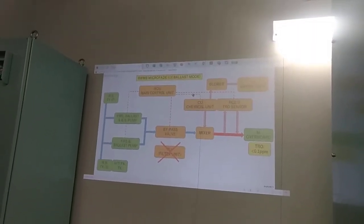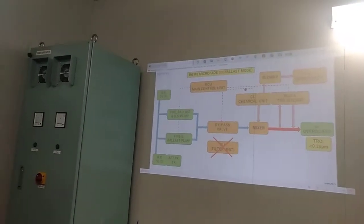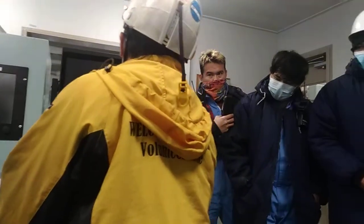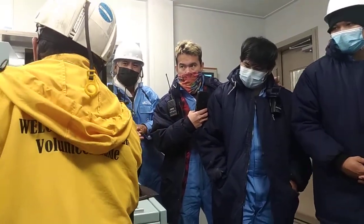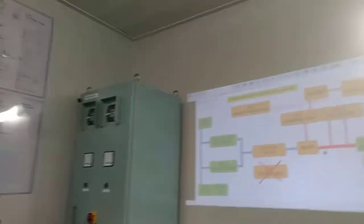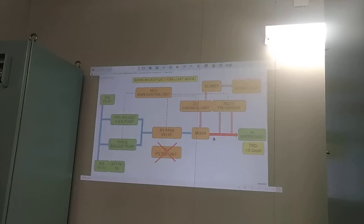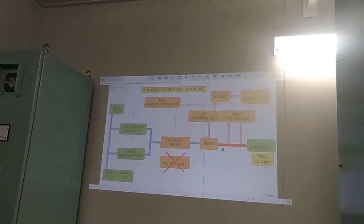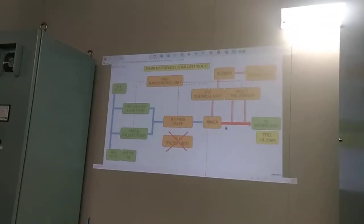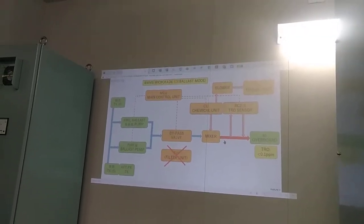Yes, sir. What happens if it takes a long time to stop? The pump or the pipe may possibly burst? No. Or it will automatically bypass; it will just continue to pump, but your seawater is not treated, because there is no circulation. The ballast water management system is already stopped. Your pump will continue, but the water is not treated. So be careful with the ballast, because they will check the water that you throw out. Every port is very strict during the deballast. Pump in, no problem, but pump out is the big issue.